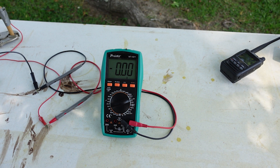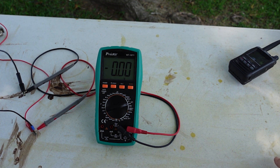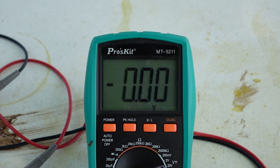In one of my videos I said half wave, but it's a quarter wave. So we're testing on two meters — two meters divided by four works out to 19.5 inches, give or take. That's what I have our wire cut to. I'm going to hold the radio at the corner of the table off camera at a spot where I know exactly where it is, so that the relative readings are exactly the same distance from the transmitter to the RF detection unit. We're going to be testing on 146.52.